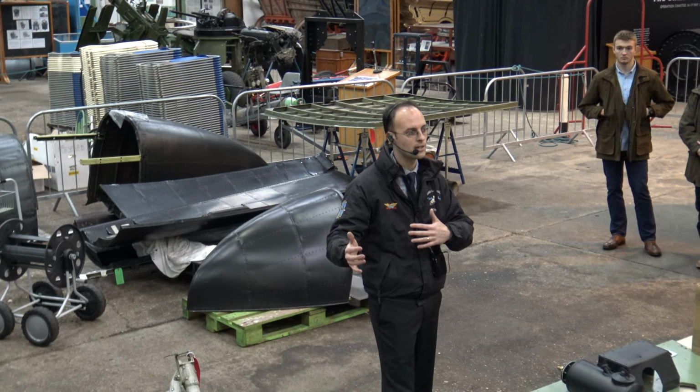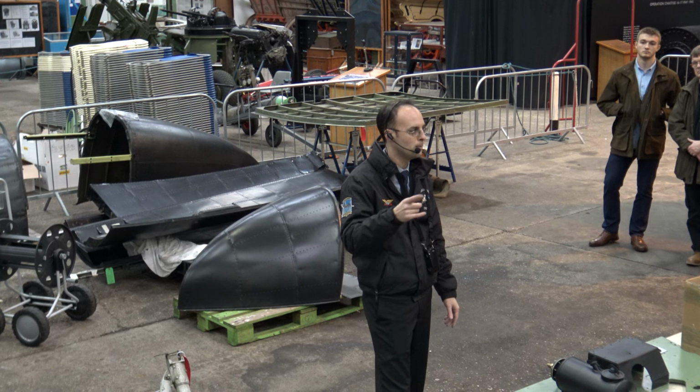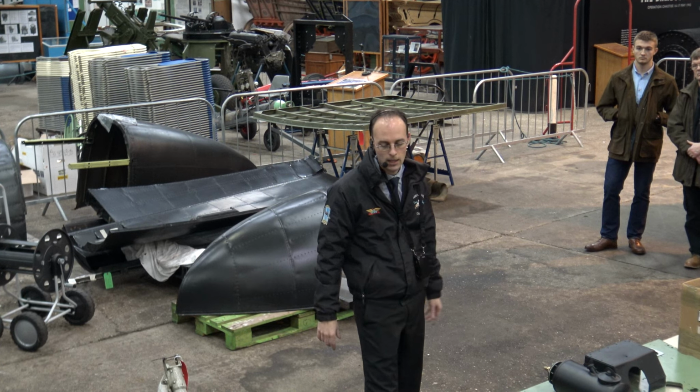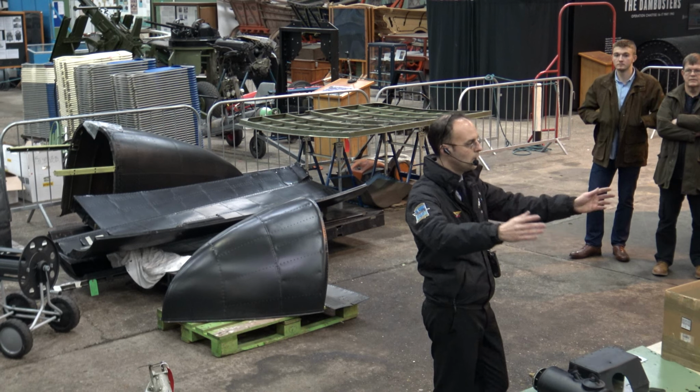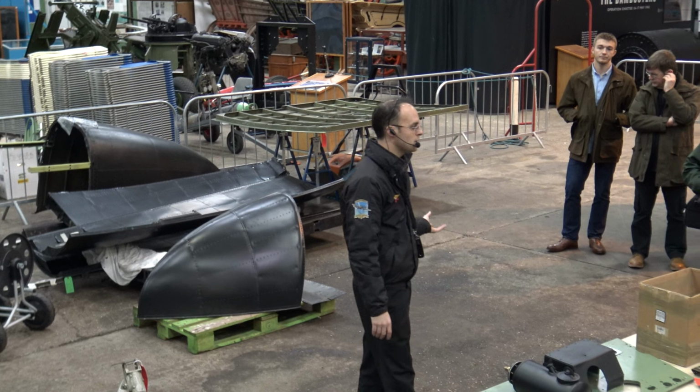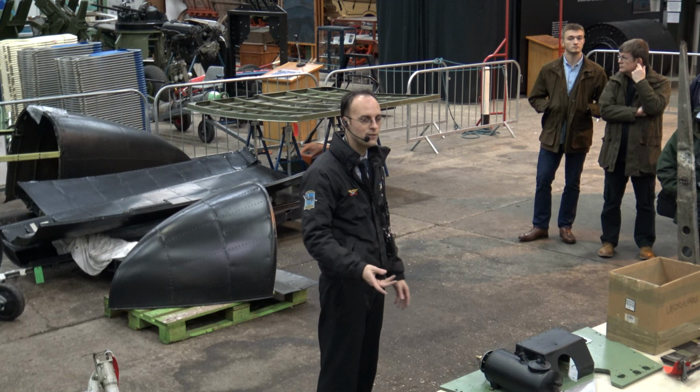Because basically that's 4 bolts to remove from the aircraft and all the other plumbing and attachments. Much easier and quicker than removing an engine from a power plant. So they're on the starboard side of the aircraft there, as you can see. The engine bearers, basically the arms that the engines sit on, have also been removed for NDT. They've been away, been x-rayed, and they come back to be refitted.